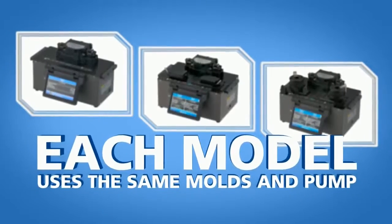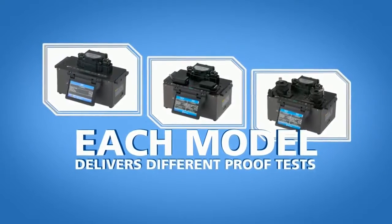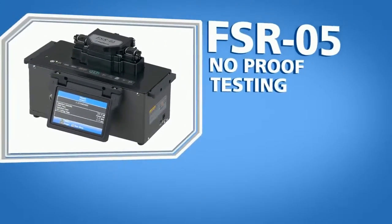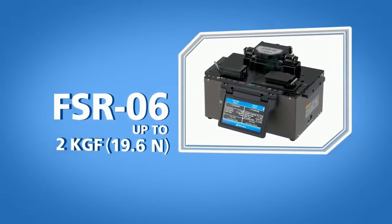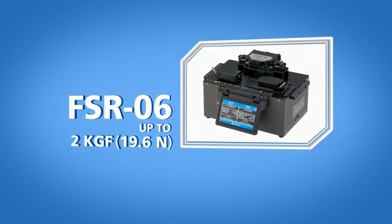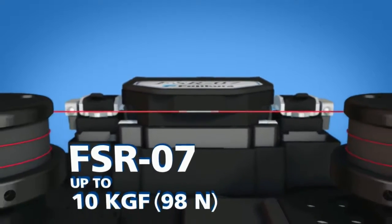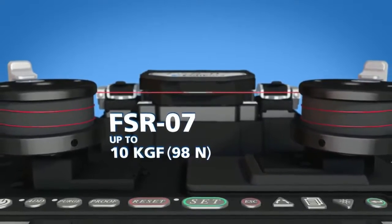Each FSR model uses the same molds and pump mechanism, but delivers different proof test levels to meet individual needs. While the FSR05 does not have a proof tester, the FSR06 can proof test to 2 kgf or 19.6 newtons, and the FSR07 can proof test to 10 kgf or 98 newtons, which is typically to destruction.